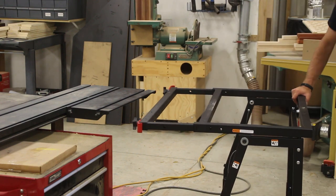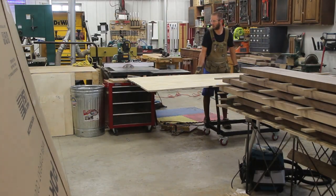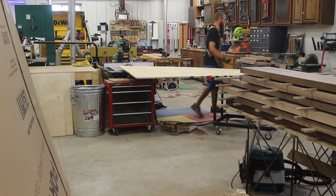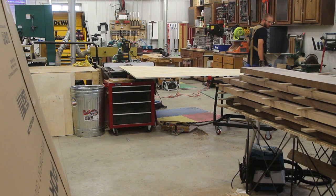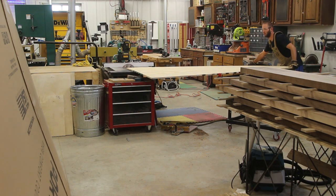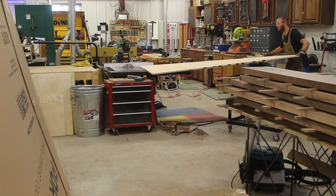When you're actually loading your material into this and using it as a panel cart, you simply tilt it back up into a shop stand configuration. With the unit set at your table saw height, or just a hair below, you now have a nice smooth delivery method to your table saw, which makes that very safe and also protects your material.